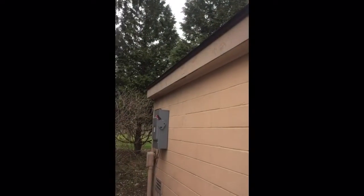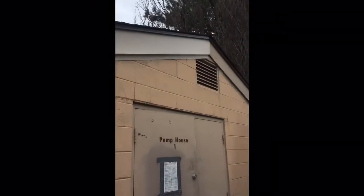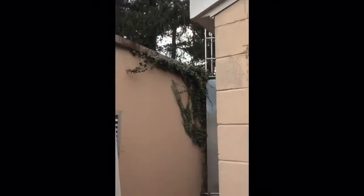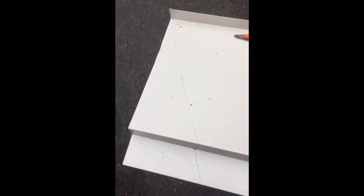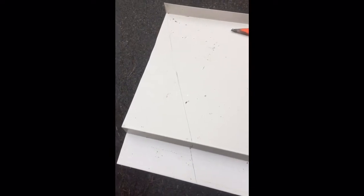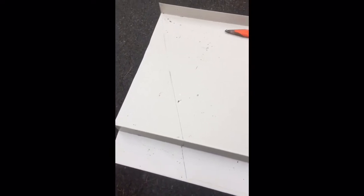So we did the soffit in just flat stock because of the tiny size of it. Nothing's vented, nothing's heated. First piece of fascia is on, and I left an inch past. I'm just gonna show you a little trick to get a really nice miter at that corner. So I figured out the pitch of the roof at a 5/12. Take my fancy speed square, set it up for a 5/12. I'm gonna cut that. And when I go up there, it should be perfect. I mean, I'll know if I screwed up right away. But that's a lot easier than trying to bring your piece up.